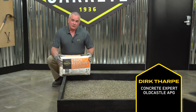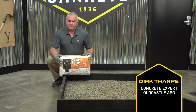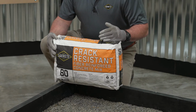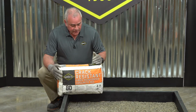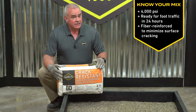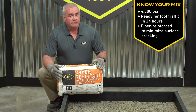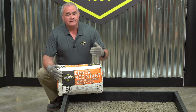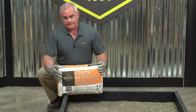Welcome to Sakrete Pro Tips, how to pour a concrete slab. Today we're mixing Sakrete crack-resistant fiber-reinforced concrete mix. Sakrete crack-resistant is a 4,000 psi mix, specially formulated with virgin polypropylene fibers to reduce surface cracking as well as increasing abrasion resistance.